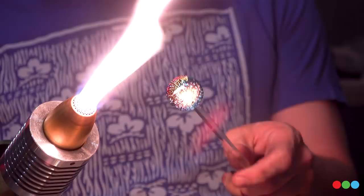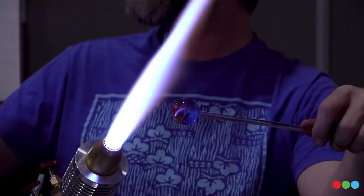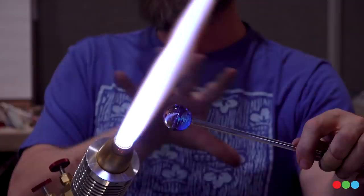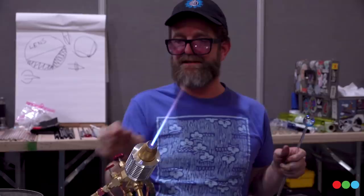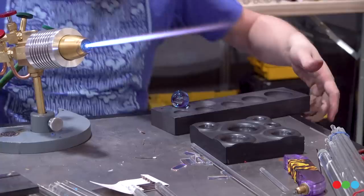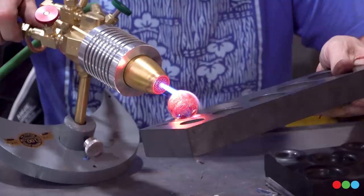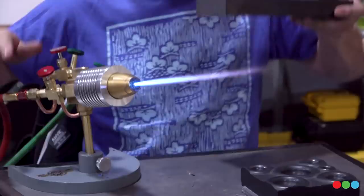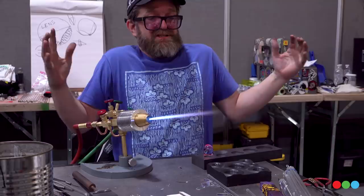No burnout, bright color. It's so much about protecting that coating and taking all the caution in the world. This lens — get a small flame ready. Into one of these cups that will hold it. Look at that beautiful release. Level out the torch, punty mark facing outward, rotate around the punty mark so that the glass relaxes to the outside and does not bead up. Our intuition is to go right onto the punty mark with heat, but when you do that, the glass actually beads up to the center. By heating the outer edge of a punty mark, the glass not only relaxes to the center but to the outside — that's how you make a nice punty mark.